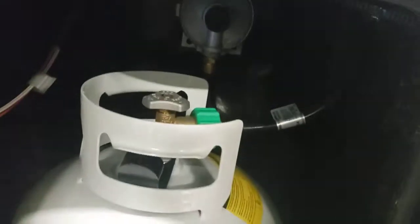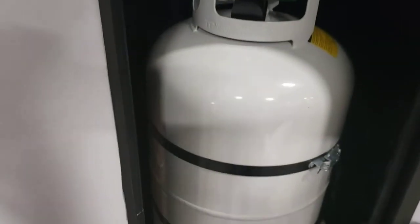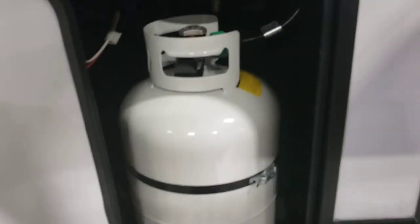Here is one of your propane tanks — they're both off right now. This one has your two-stage regulator. There's a little black selector piece that you can kind of see — follow the hose and it goes to the tank on the other side, so it'll pull propane from that tank first. You can have them both on, and it'll still pull from that tank first; once it empties, it'll automatically switch to the other tank. However, that little black selector doesn't rotate when it switches over, so there's no indication it's switched. My recommendation is just leave one off — that way you know when you're down to one tank so you can get it filled, rather than ending up high and dry with no propane.